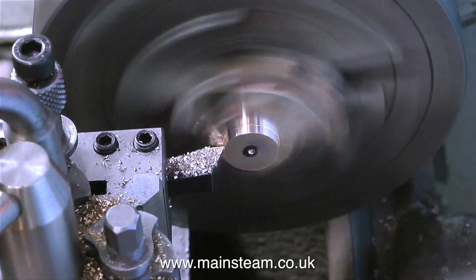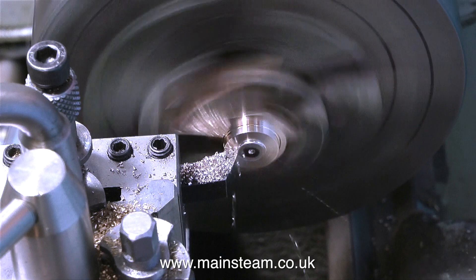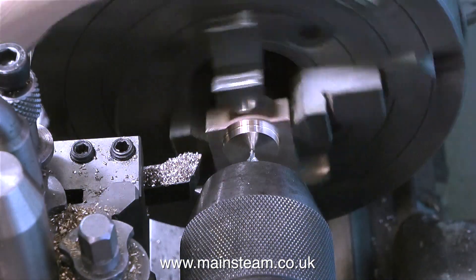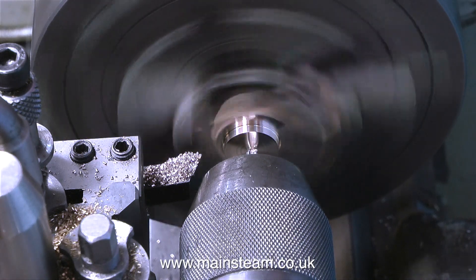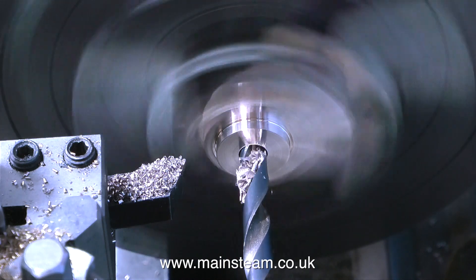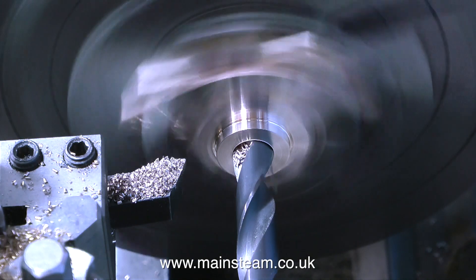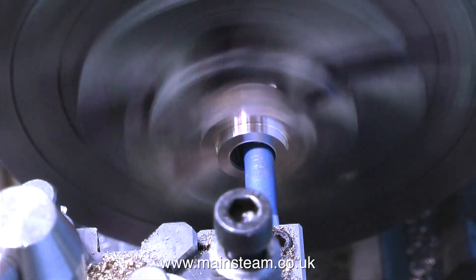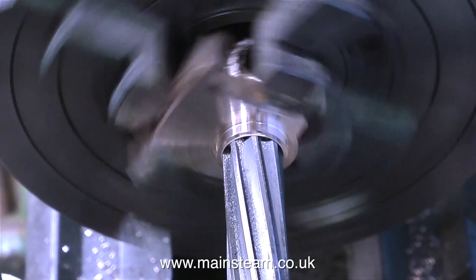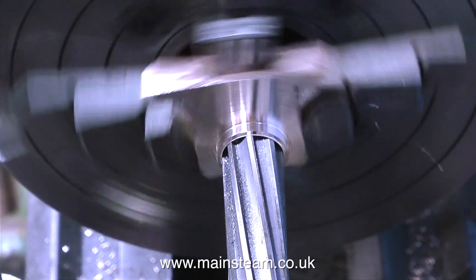What you're watching at the moment is me reducing the outside diameter of the centre boss — I need to get to clean metal through the casting skin. Once I got through to clean metal on the external diameter, I just faced the end. Now I'm using the centre drill for real, to make a good deep centre drill mark in the centre of the work, and I'm following this through with a 9/32nds twist drill. Then I used the next size up from the drill set, and now the hole is just big enough to let in the boring tool. I could carry on just upsizing the drills and going through, but they're quite brutal at larger sizes, and this is quite a fragile part — it's gun metal, it's soft-soldered together — so I used the boring tool to do most of the work.